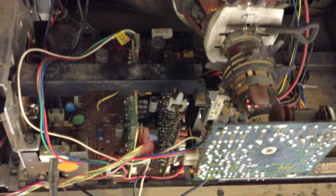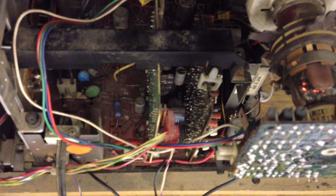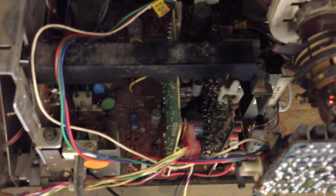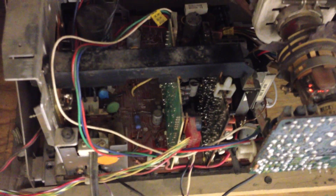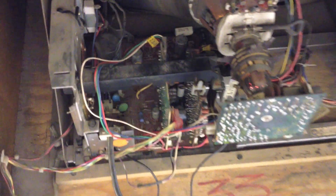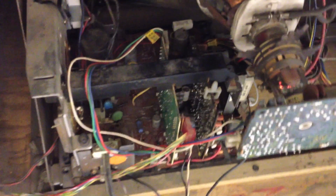That's if you have this set up. You might not have that, and in that case it wouldn't make a difference. But I would still poke around — you've got to look pretty closely at these connections. It might pay off just to re-solder them all if it's a small area. I'd like to thank ArcadeRepairTips.com for helping me fix this — awesome videos, you should check them out. They've got a lot of great stuff.